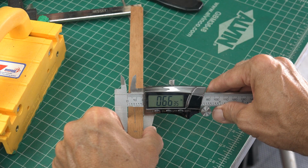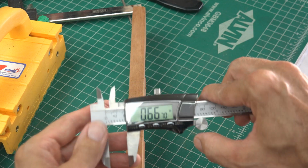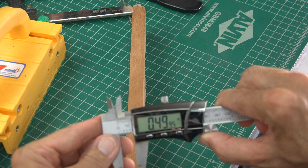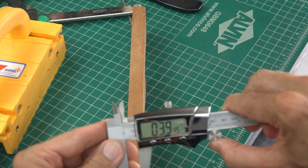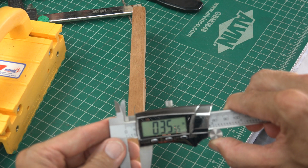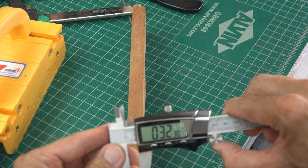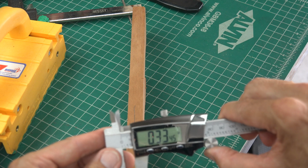I'm pretty sure I've showed you this trick before, but take a pair of calipers and get the width of your piece. Now grab your iPhone and divide that number in half. Yes, your phone has a calculator on it. Did I tell you I'm afraid of public math? Now divide that number in half and set your calipers to that number.